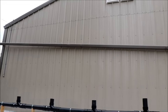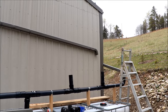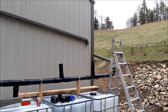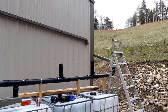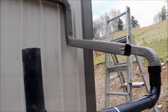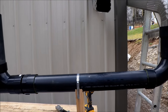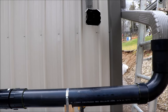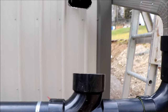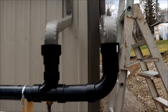We've got the main pipe on the east side of the building to where it will start coming down. Now we need to figure out the lengths for the two outriggers — we want to make them parallel and looking neat. Then we have to cut into the black ABS pipe to connect everything. We've determined where the south-side downspout will come in relative to the ABS pipe, so now we're figuring out where the Y will go. We'll mark the center, make cuts, and dry fit it.